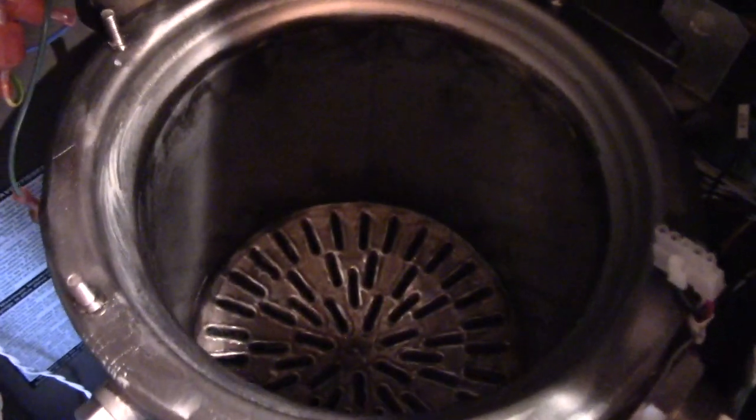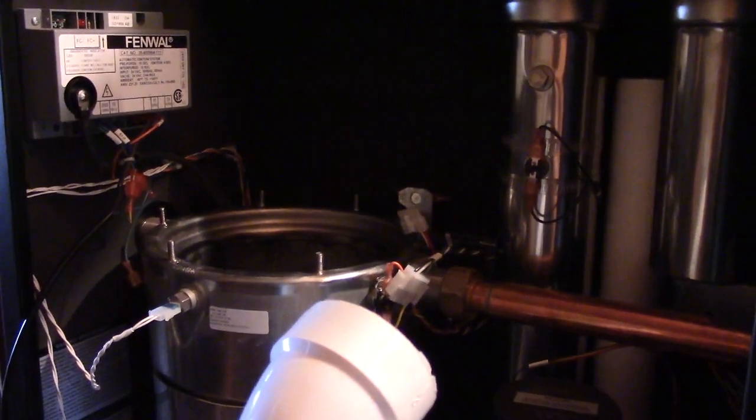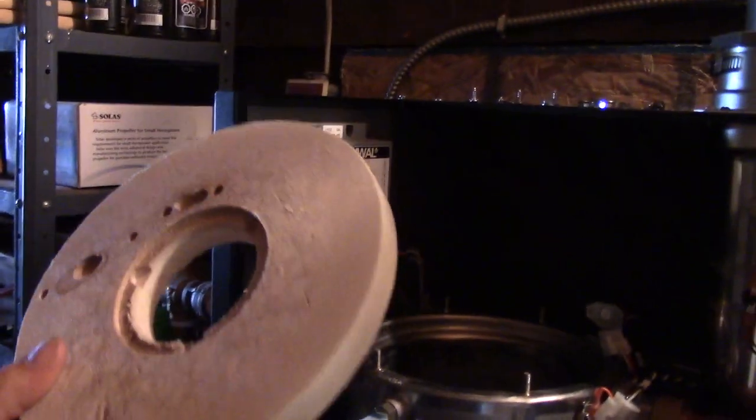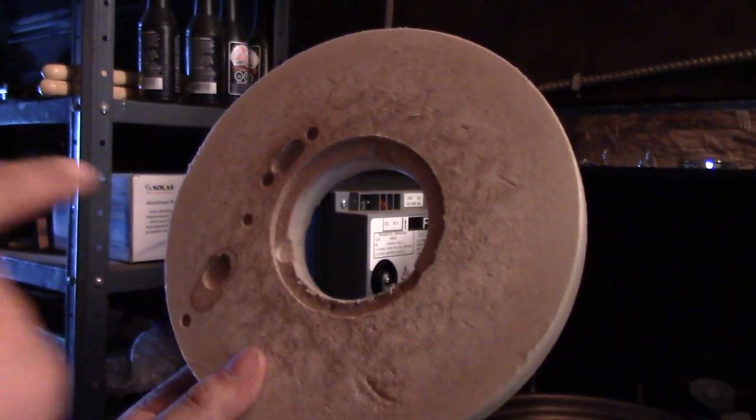As you can see, she's basically like new now. If you do this on a regular basis it'll never get to a point where it becomes impossible to clean. These little openings here are all the flue passageways — it's a fire tube boiler, so the flue gas actually passes through these small slots and the rest of the heat exchanger is filled with water. One thing to note is this refractory panel has to be lined back up in the way it came out for the spark assembly and the flame rod to fit back through properly.